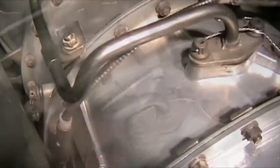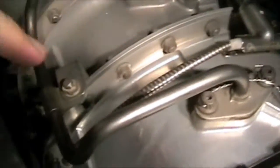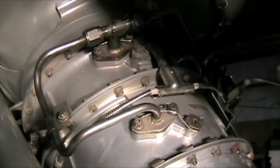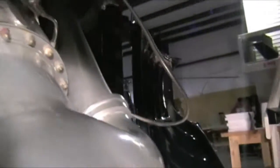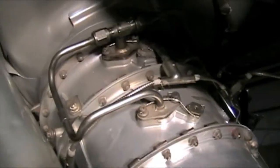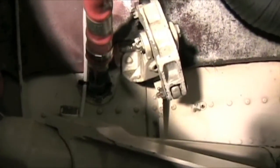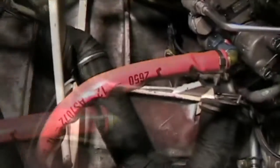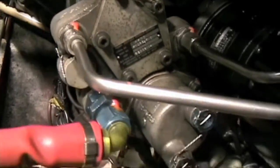This cable right here — these are your TOT temperature probes. There's a probe here, a probe down there, and a probe on the other side, so three TOT probes total. They give an average reading that runs out on a line that goes around up inside the cabin. Coming up here are your exhaust stacks — the two stacks you see. This is your fuel pickup line; check the torque stripe on the coupling and insulation. Follow it all the way around — where this line goes in is your engine-driven fuel pump. Notice everything's tight and torque stripes are in place.